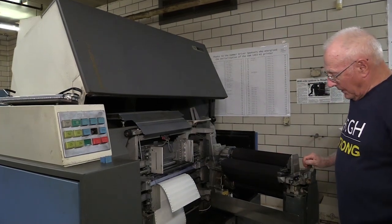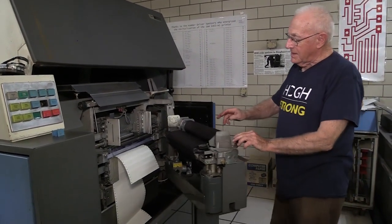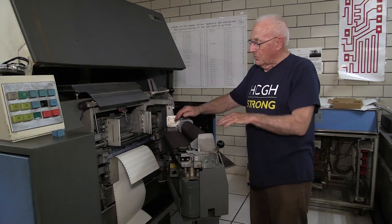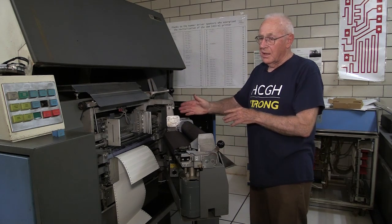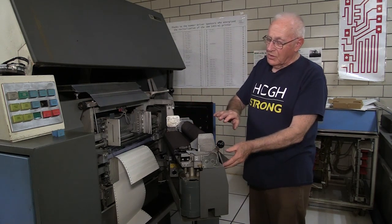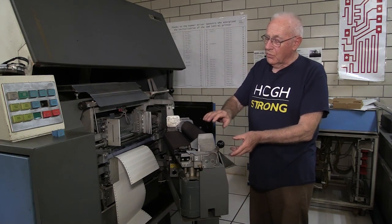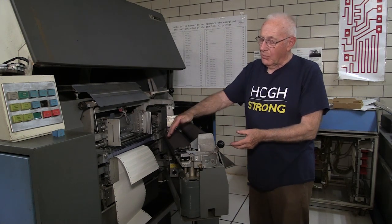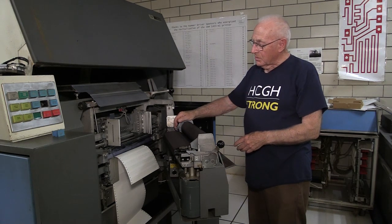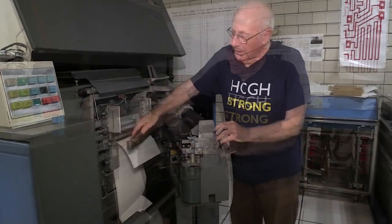The design uses a different drive but the same ribbon. Because the type moves faster, it drags the ribbon more, so we had to come up with a different steering mechanism. It looks at the edge of the ribbon, and if it's in a certain place going in a certain direction, it adjusts a wobble plate. The idler ends of the ribbon spools physically shift back and forth. There's logic behind it — it always looks at the ribbon edge to decide how to steer it.